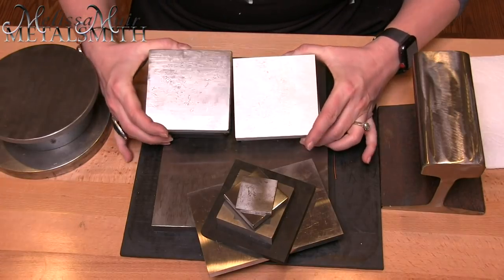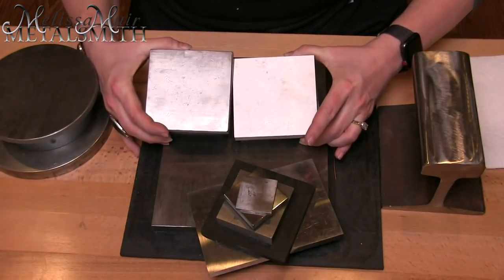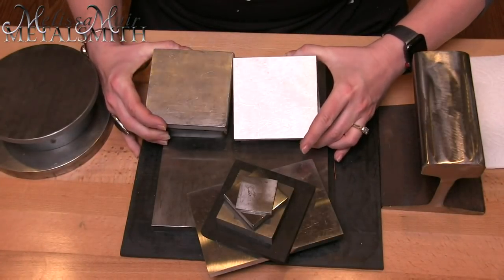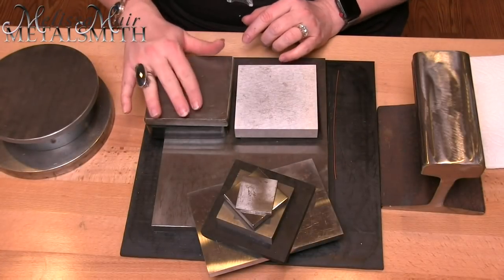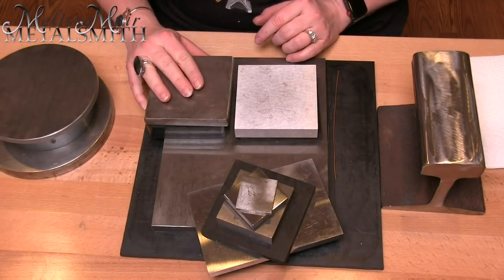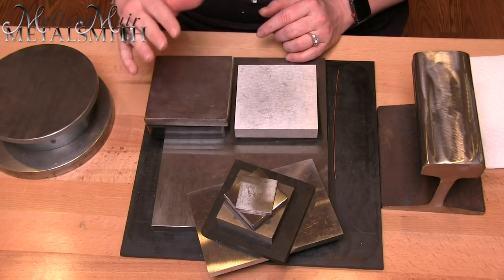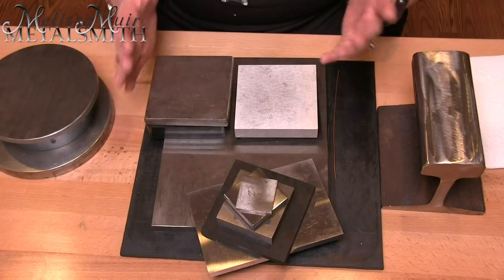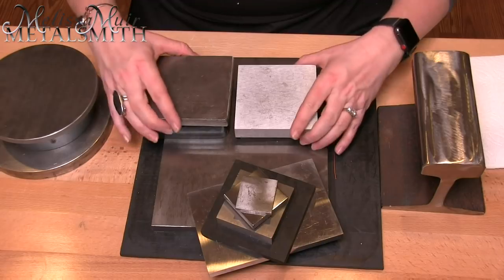You can see these two blocks have different surfaces — one surface is really fine and one is all bumpy and pitted. That bumpy, pitted surface tells me a couple of things: it's a softer material and it's probably just not as well made, whether it wasn't forged, maybe it was cast, or whatever the case might be.